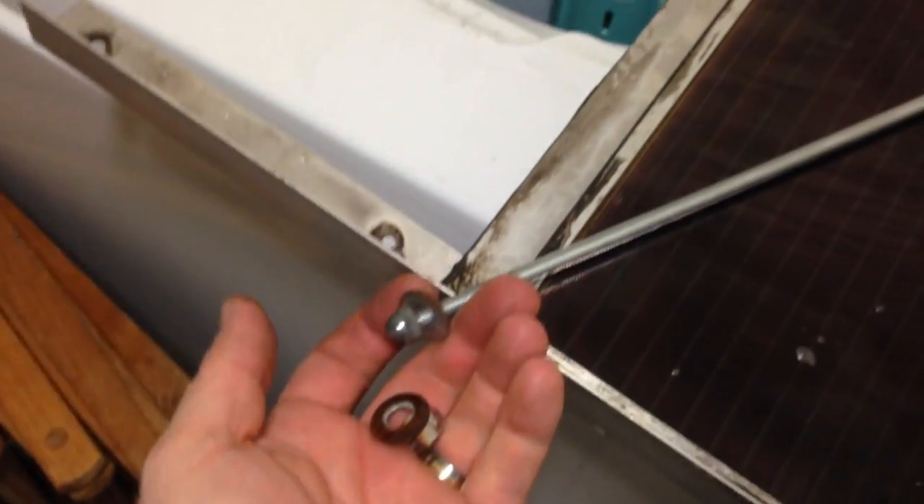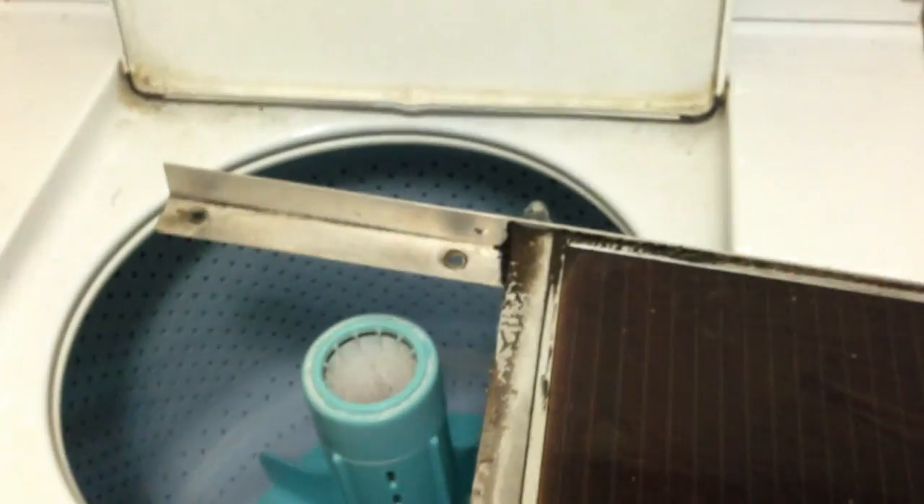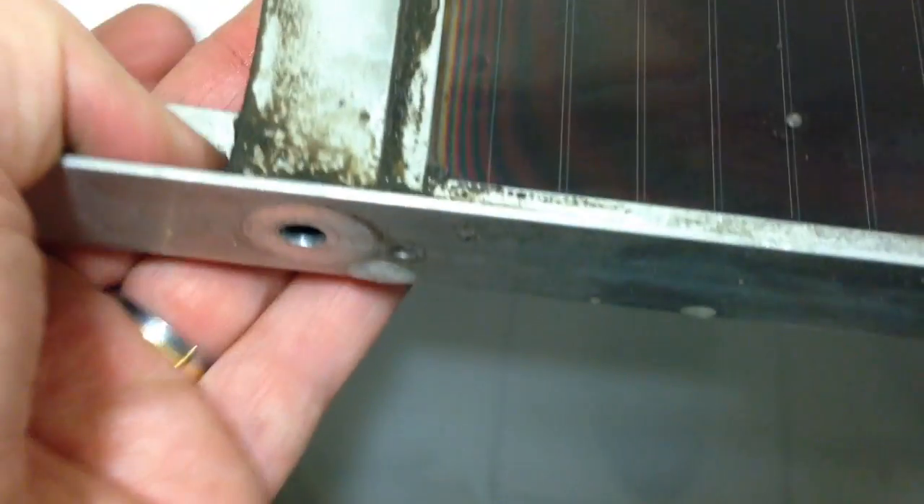In case you're curious, this is constructed very simply. It's just a piece of angle iron and square stock. I'm holding it together by putting holes in the end and taking a piece of threaded rod with acorn nuts on the end, turning it through the center. It's cut to length so that it matches, and it's held up for about eight years. I'm going to attach the frames of these panels through this exterior so the screw goes through there all the way into the frame.